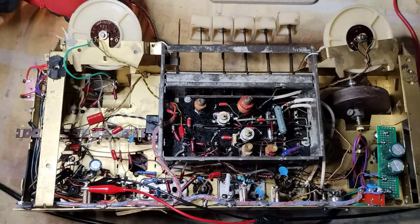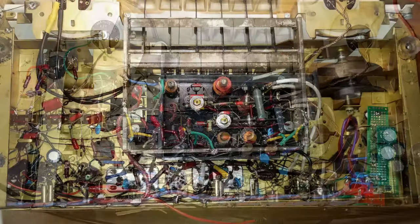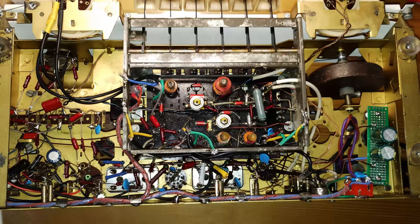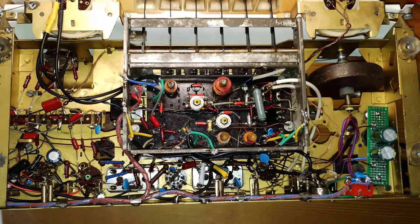At full volume, the radio showed some important hum, mostly not related to any residual ripple from the B+. In fact, turning off the radio from the power switch, the hum continued to be audible until there was still some energy available. The hum was not caused by the deviation of the input power line described earlier, because connecting the power cord directly to the power transformer and grounding the other internal wiring, including the power switch, the hum was still very loud.